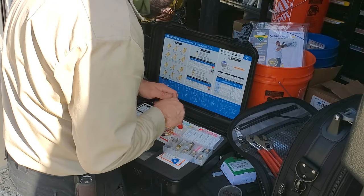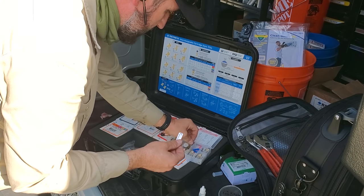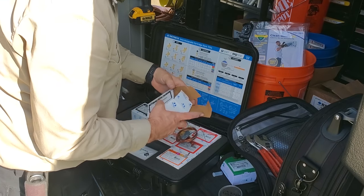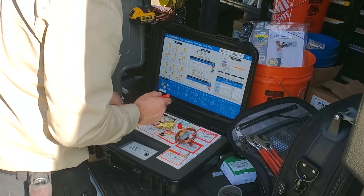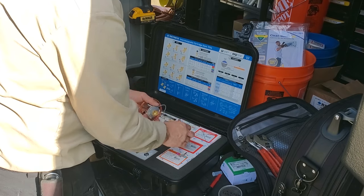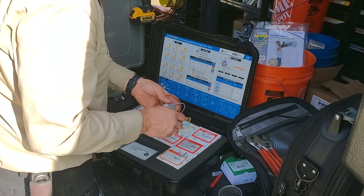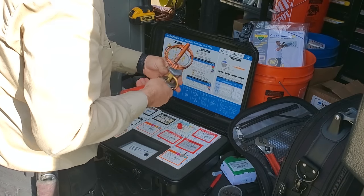The pink is a B-tag. You've got to make sure you get your little tag. Then we're going to put our power head on there. I do the same thing on the power head — mark it so I know that I need to replace it. KT43VC — that is a medium temperature: R22, R448, R449, R407A, R407C, R407F. It's a medium temp so it'll work for all of them. Hand tight and then just a hair more. I think their instructions actually say to go 60 degrees, so it's really not that much. Just a little bit more. Valve is built. We're ready to be sweating. We're good to go.